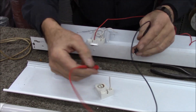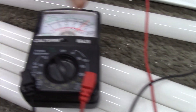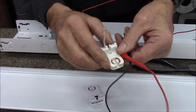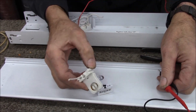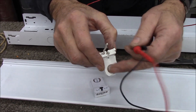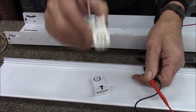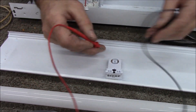With the wires not shorted out or touching, we try the two conductors and we see that the meter goes all the way across. So this tombstone is shunted — in other words, the two conductors are shunted together. This tombstone with two conductors — they're both connected together internally — is no good for us.